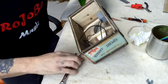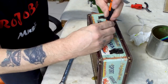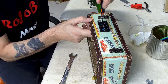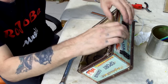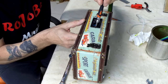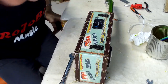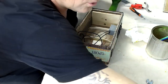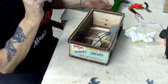We've got the wires inside now. Let me just tighten that preamp down because it's wobbling about a bit and it could break something. I've got to be careful not to over-tighten these screws because this thing is made of chipboard and it will chip. Just see if I can knit those screws a little bit tighter — not going mad. This part is only plastic so if you try to tighten it too much you'll probably end up cracking it. I need to plug in my hot glue gun and let that heat up, ready to put the pickup sensor in.